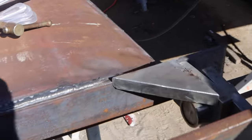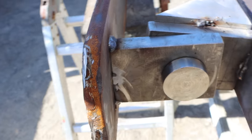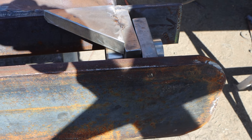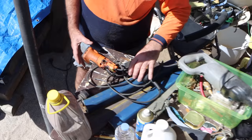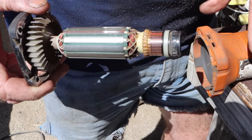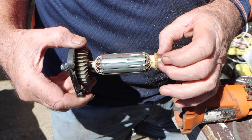These gussets get mounted onto the hinges - we've got one basically mounted here, and we're going to do an equivalent that goes between the hull hinge down to the doubler, which triangulates the load so sideways force isn't just the weld holding the hinge to the mild steel taking all the grunt - the gusset takes it too. We'll do the same at the other end of the hinge. Trevor's also playing grinder mechanic on the grinder that died - just trying to ascertain what failed so we can figure out if it's worth fixing.